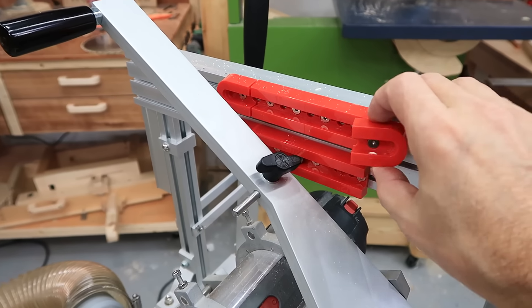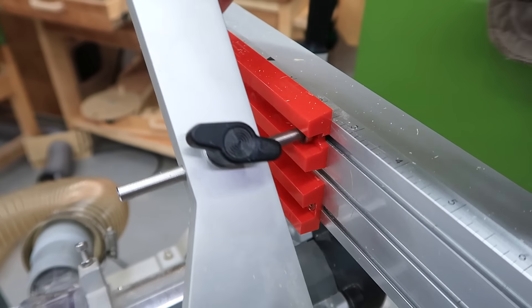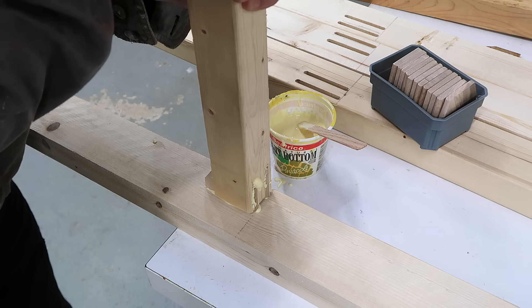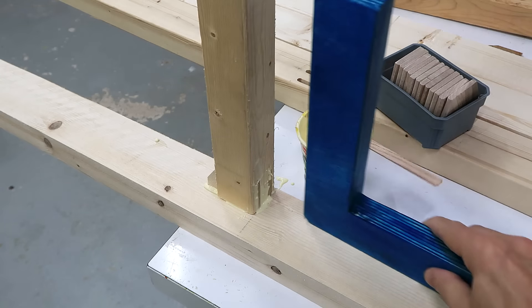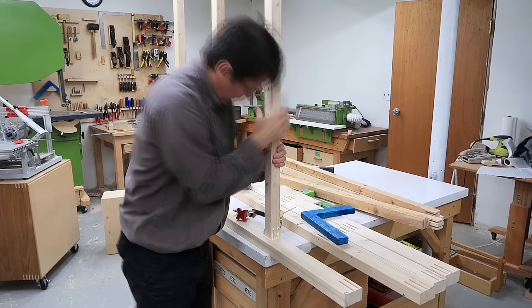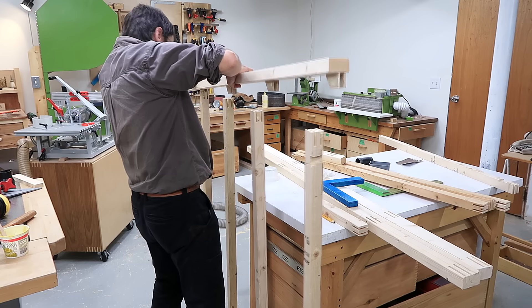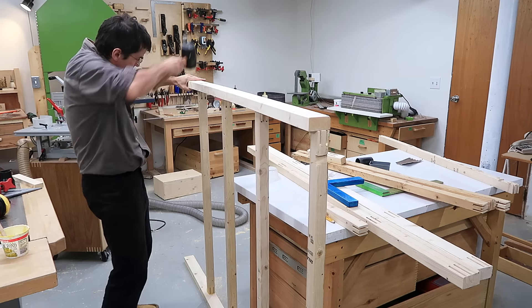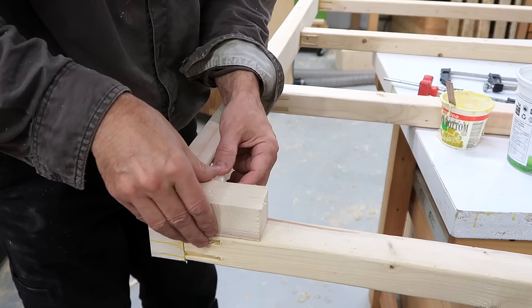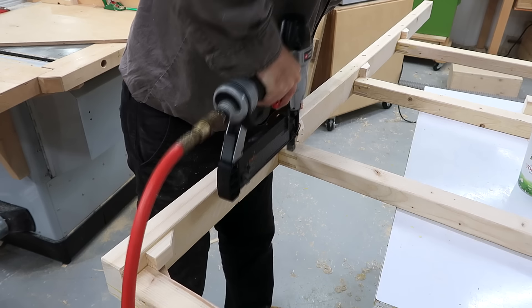For just cutting these open-ended slots, I swapped out these pieces for open-ended pieces, and that way it's much easier to go from one slot to the other. I'm adding these little blocks to support the shelf decking that I made out of pallets. I don't want to rely on the glue entirely, so I'm adding a few brad nails to my joints.